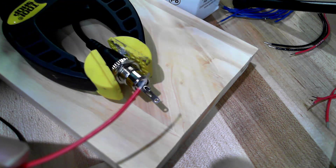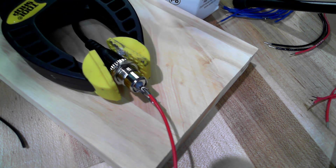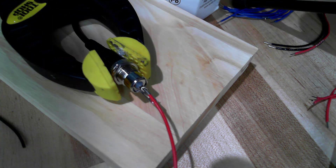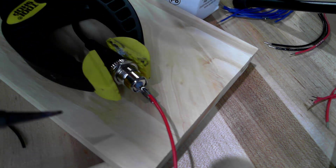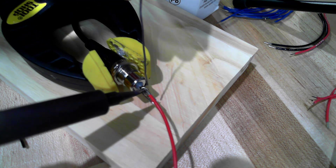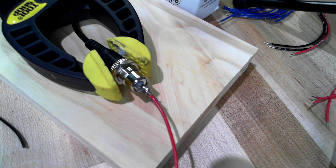I'm going to take my soldering paste and apply just a little bit on the end of this red wire, then slide the red wire into the socket on this pin. That soldering paste does two things: most importantly, when you apply heat it cleans the surfaces and makes for a faster, better wetting solder joint. It also holds the wire in place with a little stiction. I'm going to carefully bring in the pencil and get a little solder going down into that pocket — and there we have it.